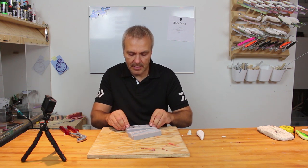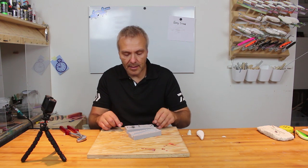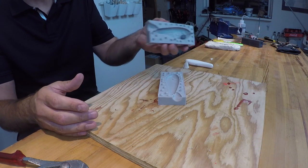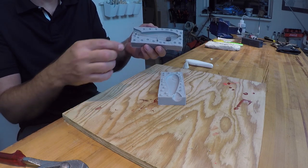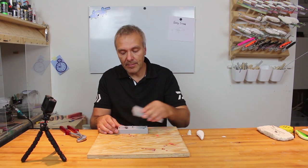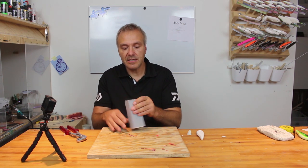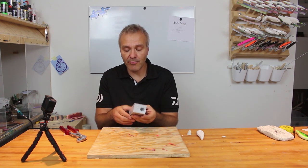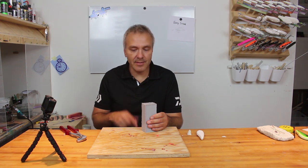But like that, as you can see, now we have the wire in place, and well, this will really stay fixed there throughout the process, and I'm 100% sure that the eye is exactly positioned like I want to. And well, now I should be able to close the mold along those pins, and I'll just put on some wooden sides and some rubber bands, mix up a bit of resin, and test the mold for the first time.